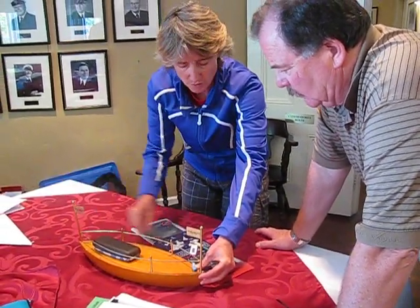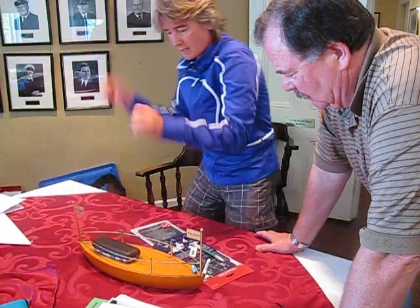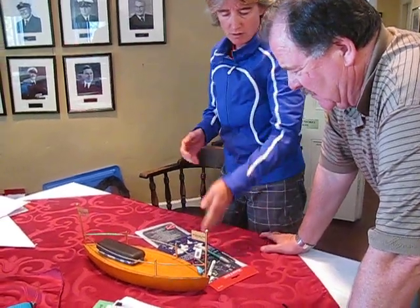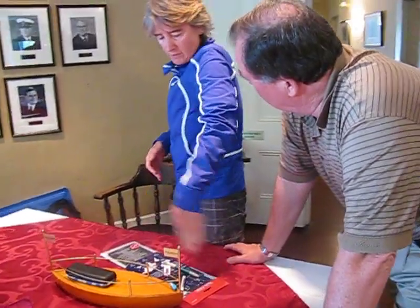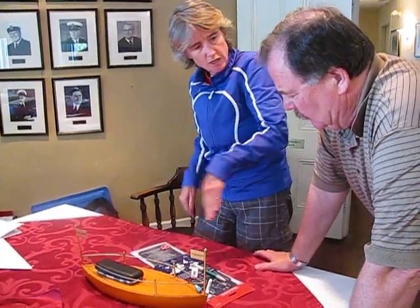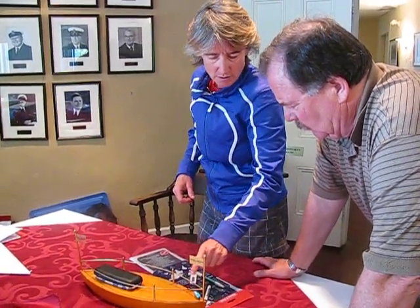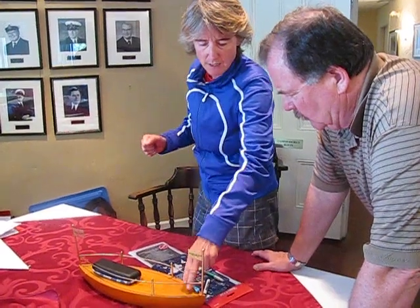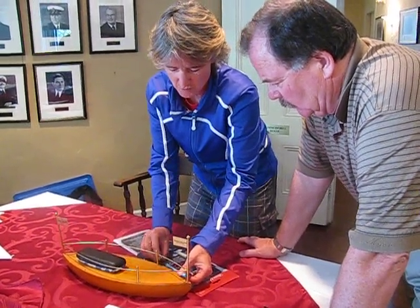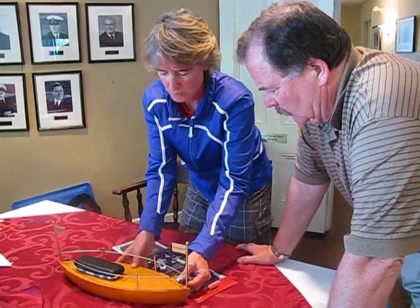I could leave this one on and try to pull my stern in, while at the same time you're going to want to drive the boat on. When I've been teaching people, they'll think they've got to get the wheel over and then put themselves in gear. You always want to start with your wheel straight, because if your rudder is down in the water and you start with a turn, all you're doing is dragging a very big board through the water — it's not helping you turn. It's like a bicycle: you have to go forward to be able to turn. Start with your wheel straight, find center. Have your crew let off the bow line, take this line out there, and pull on these. They step on as your boat starts to go forward.